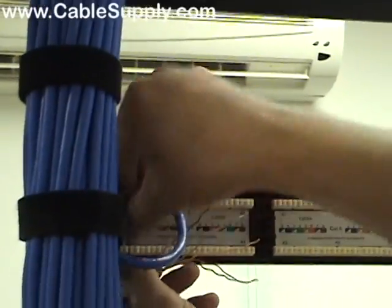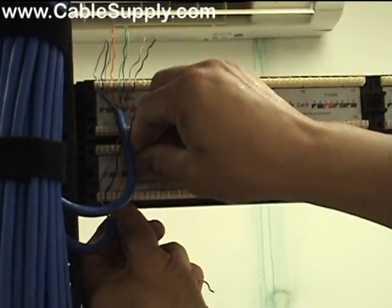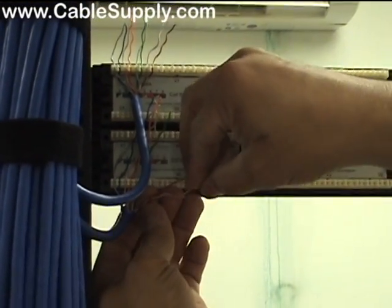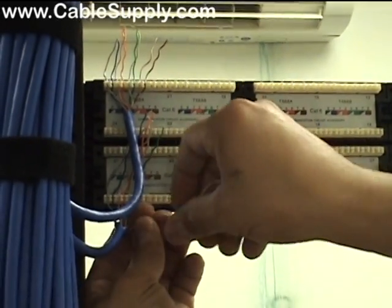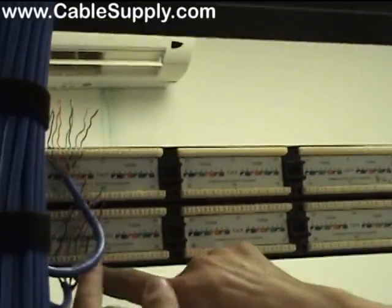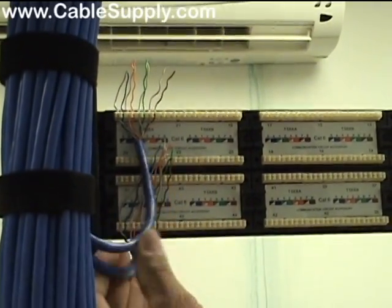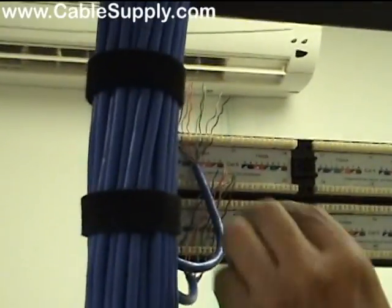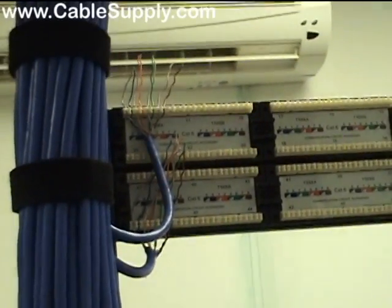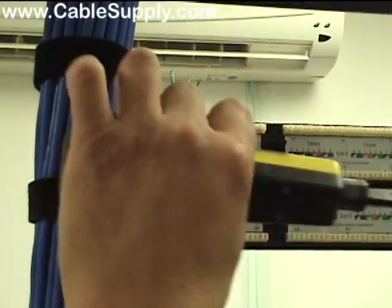It's not necessary to number them though — you can put them in any order you want and then ID them at the jack. I'm putting them in from one direction to make it uniform and dress them all in a waterfall fashion, so they're coming up into the spot needed. I'm just keeping everything uniform and clean.